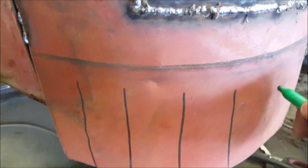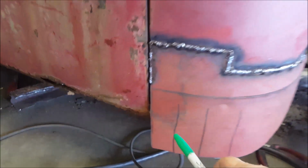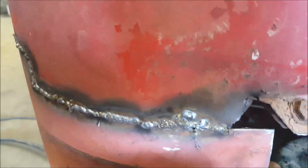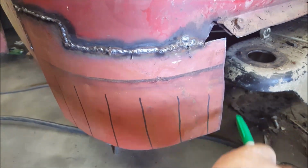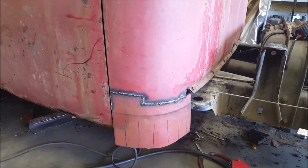Now if you can, use big areas like that. If you can't, keep cutting in between each area, between here, here, here, here, here, and here, until you can take them strips and bend them back under to where it mimics your edge here, which has to be ground off. This will have to be bent in and then mimicked also, and you'll have to pie cut this edge to get it to here. This edge right here will have to be pie cut this way to where you can fold that under. It's a bit of a big task, but it's not at the same time.